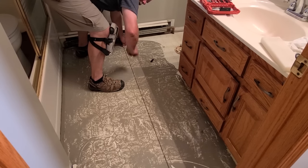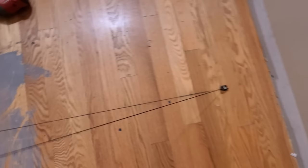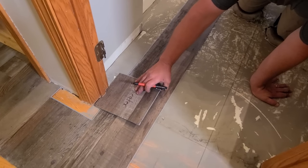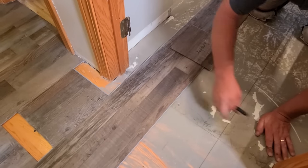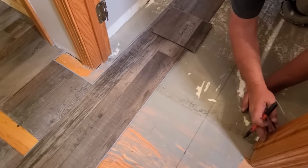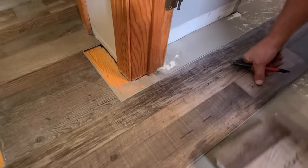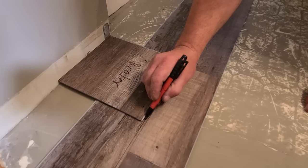Most vinyl plank you can go right over existing vinyl flooring without any prep at all — my situation was different. I measured away from the plank in the hall a couple of feet in two spots, then extended the chalk line into the bathroom using those marks as a guide. I snapped that line to help keep the plank straight as we move into the bathroom. Once I have it all straight, I take my cheater board and start marking everything out. Working away from a jam is a lot easier than working into a jam, so I try not to have a joint in the doorway until I get to the end.